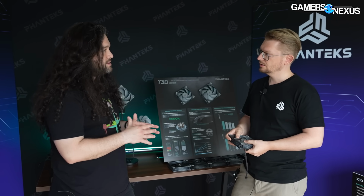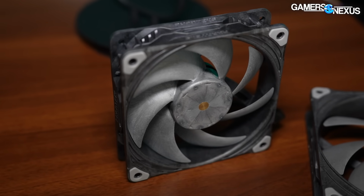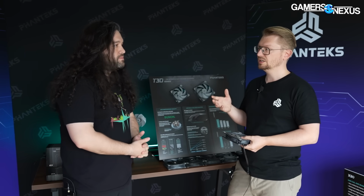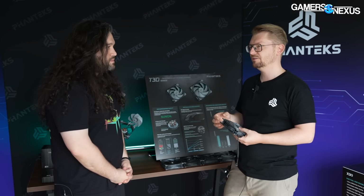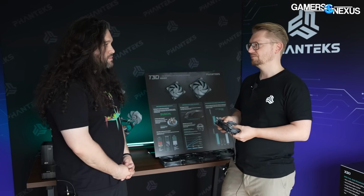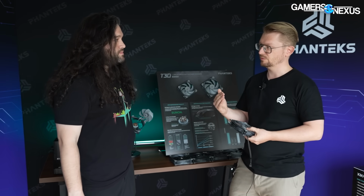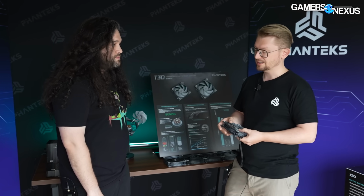Why is the maintenance a challenge? I think with materials like these, temperatures are higher, the fiber content is higher, so the wear on the machine is much greater. If you don't pay attention, it gives you trouble a lot faster. So from a manufacturing point of view, they want to push you with bigger tolerances, right? And we're aiming for tighter tolerances.